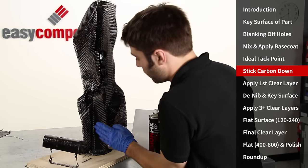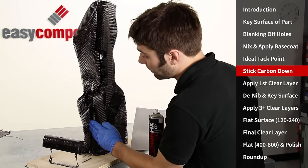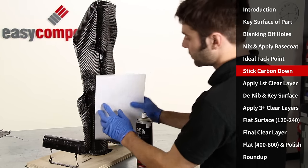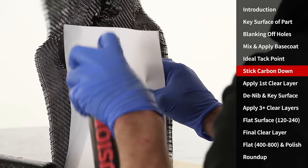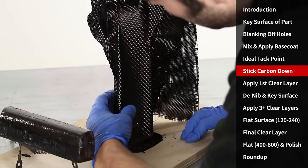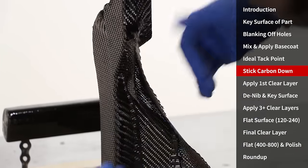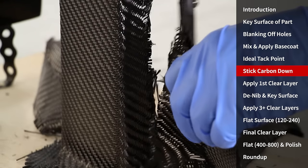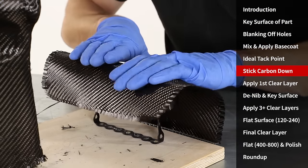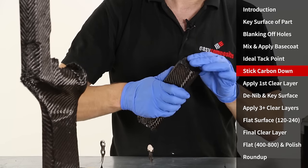To get a nice clean line at the halfway point, the first piece of material goes beyond the halfway point and then we lap over that with a second piece. To stabilize it and get a nice clean cut that bonds down onto the first layer we're going to use some Fusion Fix spray adhesive. We'll mask off the main part so we don't get any spray adhesive on the open face, then we can neatly cut the edge without any fraying as the spray adhesive acts as a binder and allows us to neatly fold it back. In corners where two pieces of carbon meet, a sharp cut will create a butt joint. We'll use the same method on the comb — start from the most visible areas, wrap it around the component, have butt joins in the 90-degree corners, and fold and trim the ends in just the same way.